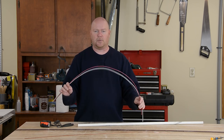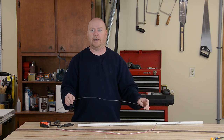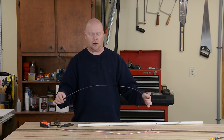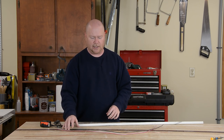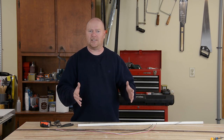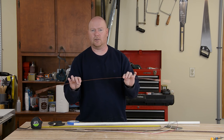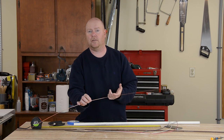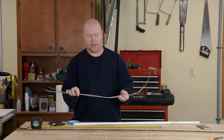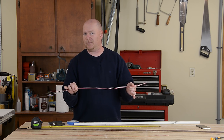I need something to make my elements out of, and that's where this comes in. This is just a random length of 12 gauge electrical wire that I pulled out of the main sleeve, so I have four different pieces of copper that I can trim to the various lengths for the elements I need. The ground wire from my Romex is already bare copper — I'm going to use that for the driven element, the one we're hooking up to the radio. The other wires are insulated; in theory they ought to be bare copper, but I'm going to try it without stripping them to see what happens.